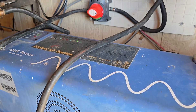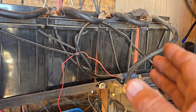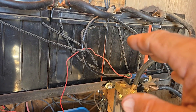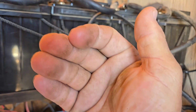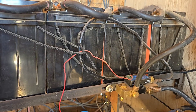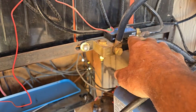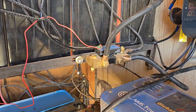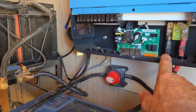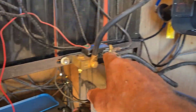In order to do that I've got to shut my power down, and at the same time I need to rewire and rearrange these batteries. I've got to flip two of them around so the positives are on this end — then it'll be easier to wire them in series, since they're in parallel right now. This system here will be coming out; I won't need it anymore because this new system has Wi-Fi and Bluetooth.